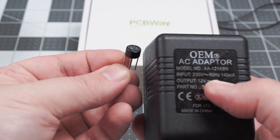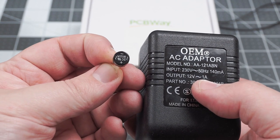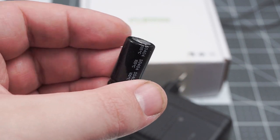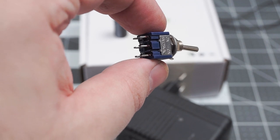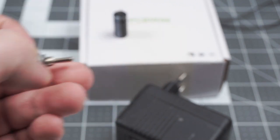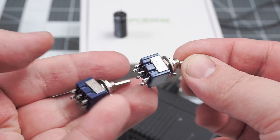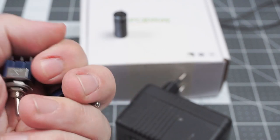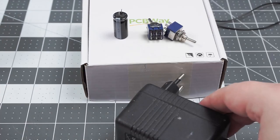An AC wall-wart can be made to output DC for the etching process by adding a diode bridge rectifier and an optional smoothing capacitor to its output. By using a double pole double throw switch, output can be switched between AC and DC. Another switch can be used to disconnect the output leads to avoid accidental short circuit. For those who are familiar with electronics, this is a simple circuit which is easily made without the circuit board.